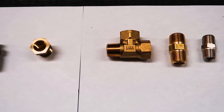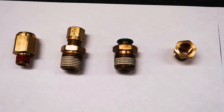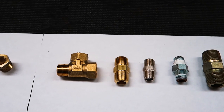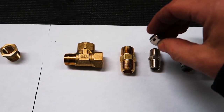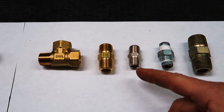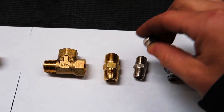The most important thing to watch out for when selecting fittings is to make sure you use a non-ferrous metal — either brass, or you can even look at stainless, but once you see the price of stainless you're not going to want to buy them. A quick easy way to tell is to take a magnet and touch the fittings — if they don't stick, they're going to be brass. Some, like this one, are brass that's been nickel plated so it looks nice, yet it's still not magnetic.